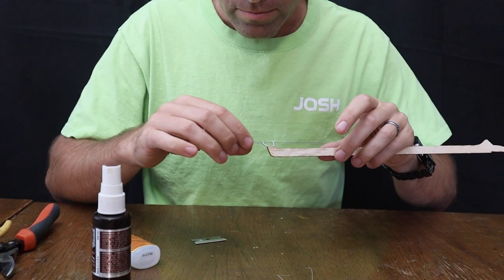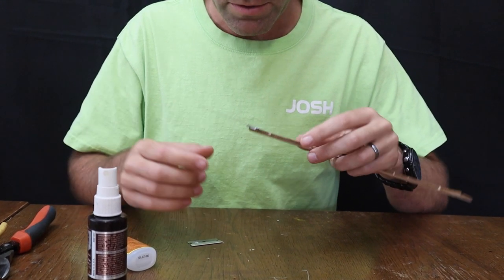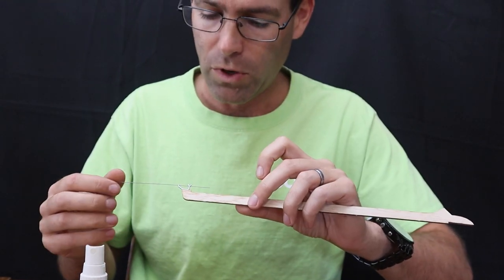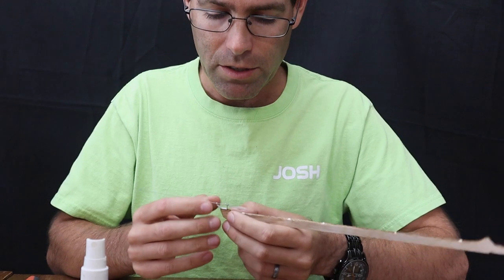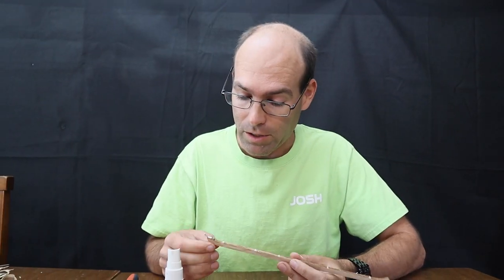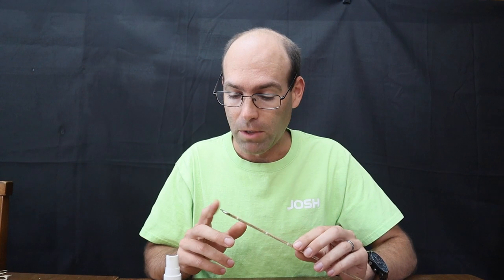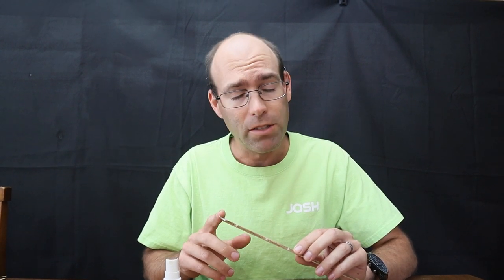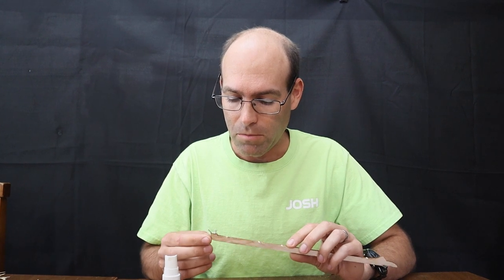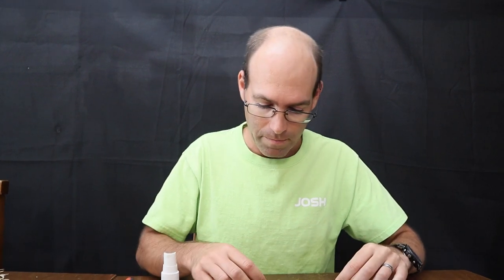You only need about 3 degrees of left offset usually, but you need some. More than 5 degrees usually is an indication that there's a trim issue elsewhere in your plane, or if you're flying in a really tight flying site like a living room, that might also be useful. But the bottom line is about 3 to 5 degrees is where you want to be. Any less and the airplane doesn't turn well anymore and you're losing efficiency.